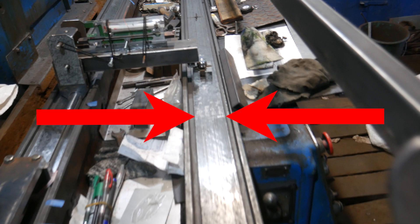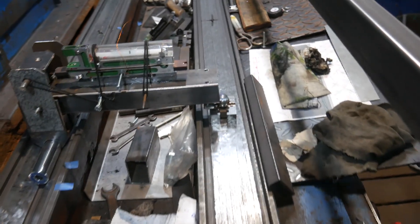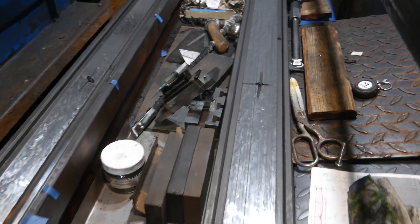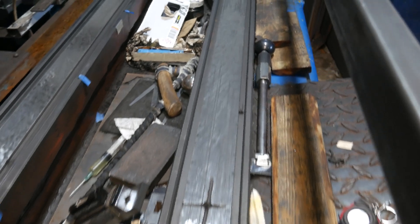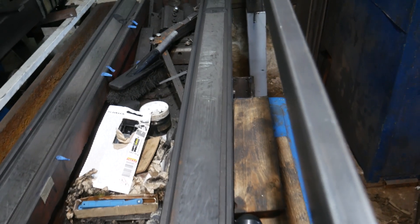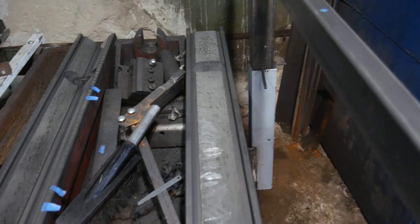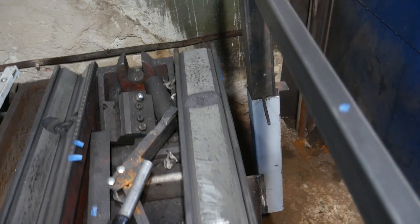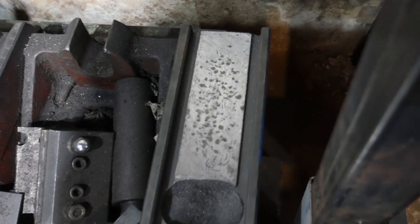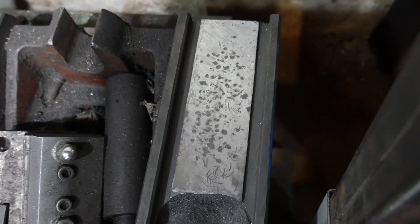It is 60 millimeters wide. Like the V-shaped prism, this second flat guideway line has significant wear from decades of machine operation — the machine itself was manufactured in 1971. Someone even used this surface as an anvil, but fortunately, measurements showed that this area was the highest point on the line, and the section will be removed after scraping.